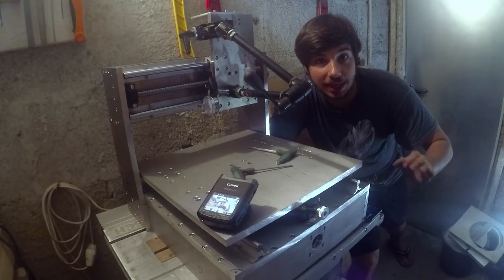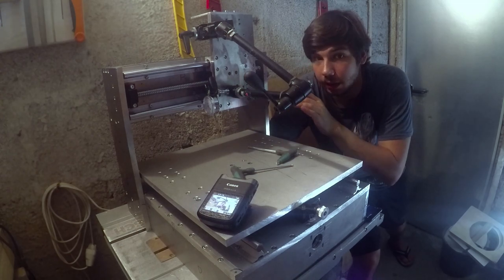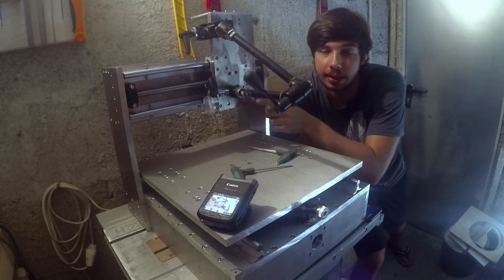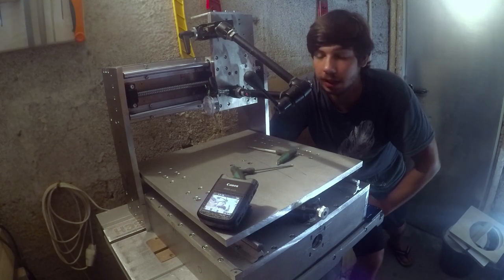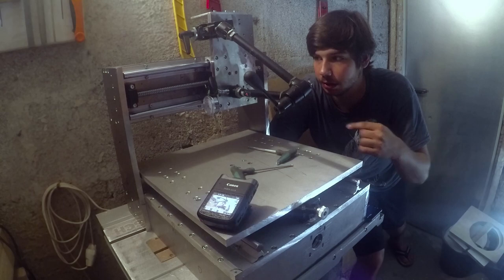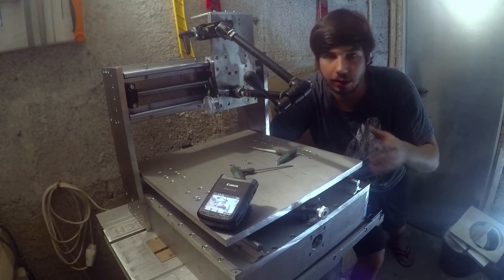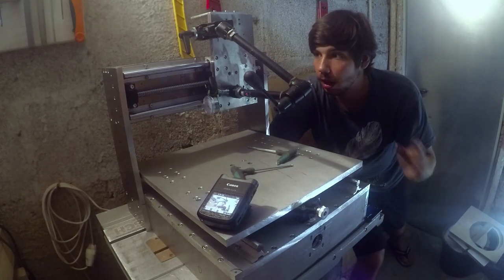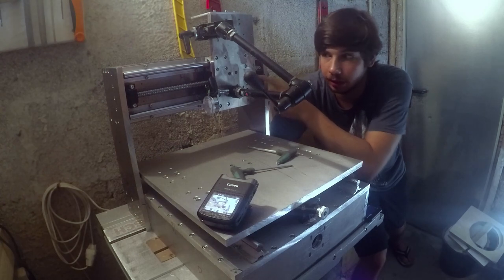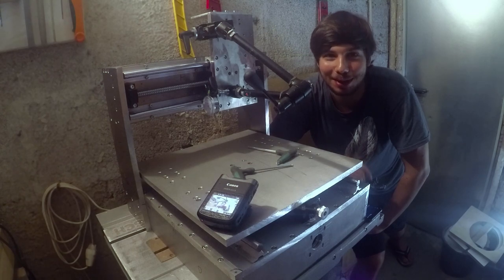It is now about 90 minutes later and I wanted to throw this thing against the wall at least five times. It is so sensitive that everything counts — you tighten the screws and this thing goes off by 10 hundredths of a millimeter. You need to approximate beforehand how much the screw turns will affect the reading and take all of that into account. It took me quite a while to get this dialed in, but now I got the bottom linear bearing and the ball screw bearing all within three hundredths of a millimeter. I am pretty proud of that.